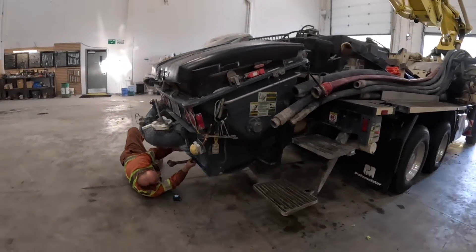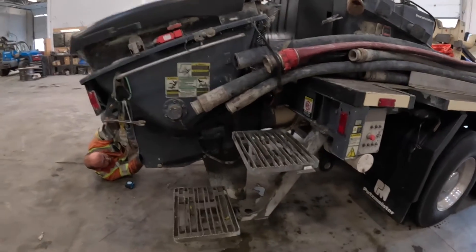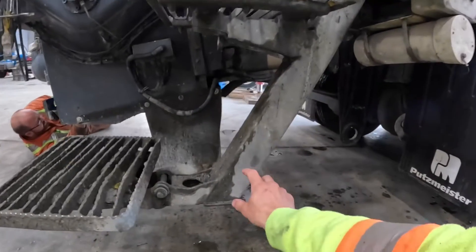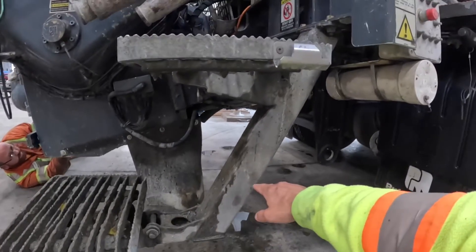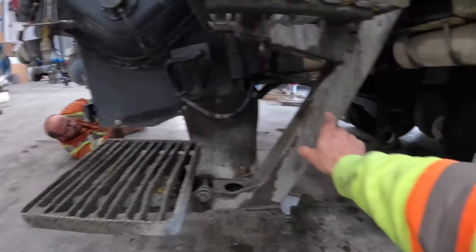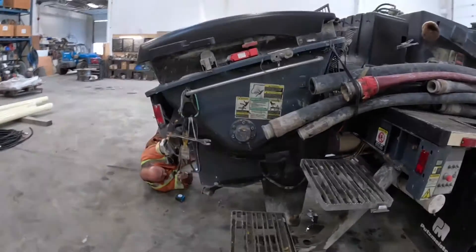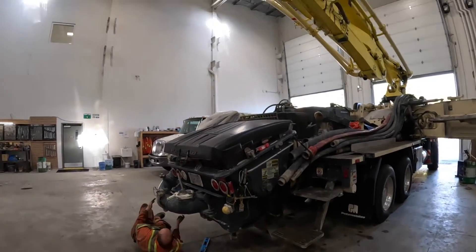With how low this hopper is right now, it does — by design or not I'm not sure — kind of save the steps from dragging and getting destroyed. We're also going to — not today, but in the near future — shorten this back step by probably an inch and a half. I'll cut it right here, bring it up, put a piece of tubular or rectangular steel in between, and splice it back together. For now we're gonna start with the hopper, so I'm gonna insert some photos of the procedure right here.